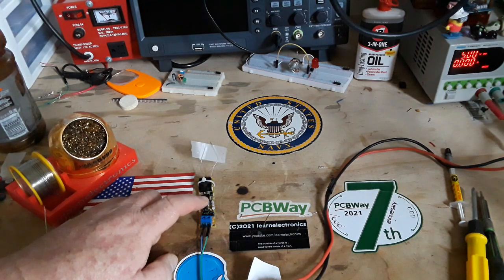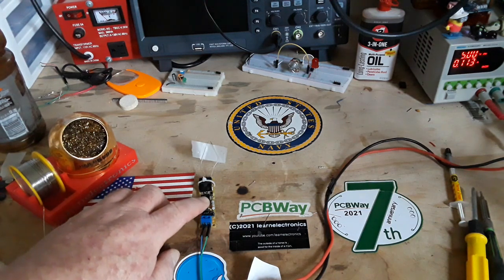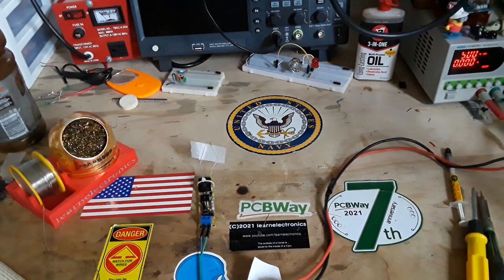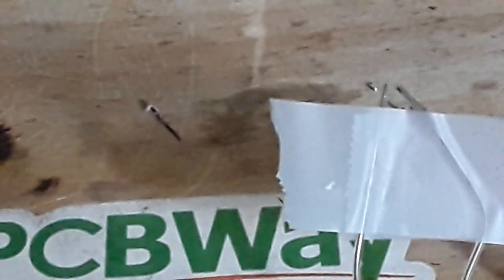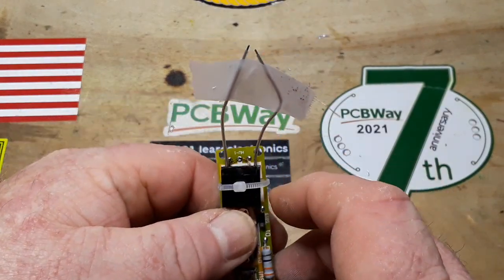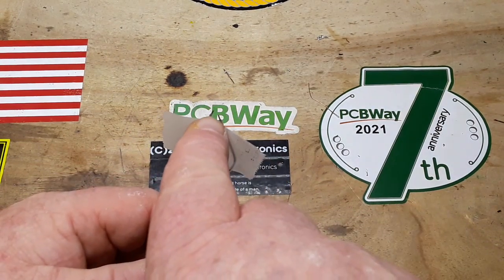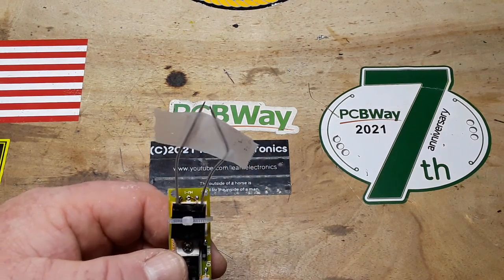Okay, there is an arc but man, it's light. Let me try something — a little bit of sanding, a little darker out. Ready? Press the button — yeah, that's pretty bright! What I ended up having to do was clean off more of those wires. Oh, there is a strong smell of ozone. If you get yourself one of these kits, make absolutely certain that your gap width is a millimeter or less, or you could burn the whole thing up.